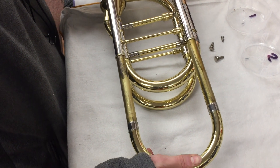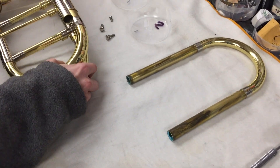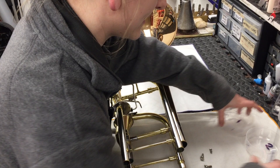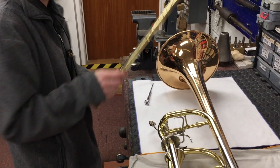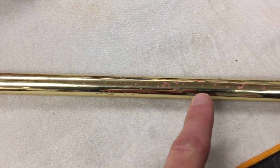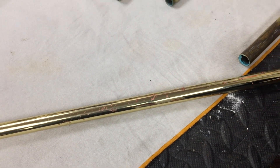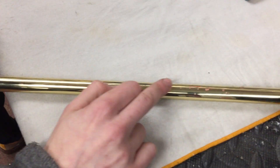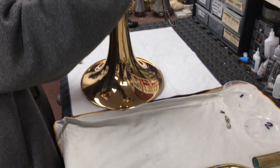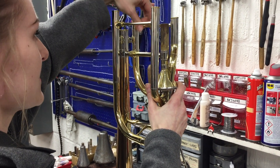So this makes life a bit easier when tackling really involved stuff. Now the slide actually holds the whole thing together, so you can lose that. There are very long legs on there and very blue on the inside — I don't know if you can see that lovely colour. I've done a replacement leg on this instrument; I'm kind of servicing the bell while it's here, why not. A replacement leg on the actual playing slide — it was really rotten. Those pink spots are a typical sign of bad news when it comes to brass instruments. The player uses his instrument all the time and had a few weeks where he didn't need it, so he got it done. I advised him about two years ago that it could eventually go through, because it's dezincification — the copper separating from the brass as a result of being left wet, which is totally normal. We're all blowing down our instruments so they're going to get wet, but this one has had it a while.